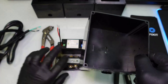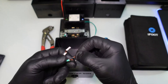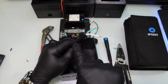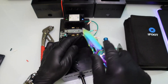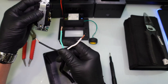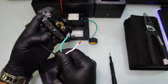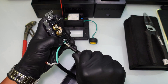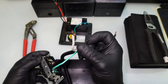Take the wire — it already has a regular wall outlet end on one side. Pull those off, then feed the wire through the rubber grommet. Strip this wire a little bit further; you may need a knife for this. We're going to put the ground wire in first. Make sure it's a nice tight twisted connection. Stick it in between the washer if there is one, or go clockwise around the screw so that when you tighten it, it does not loosen up or come out of the joint. Give it a little tug — it should be good.